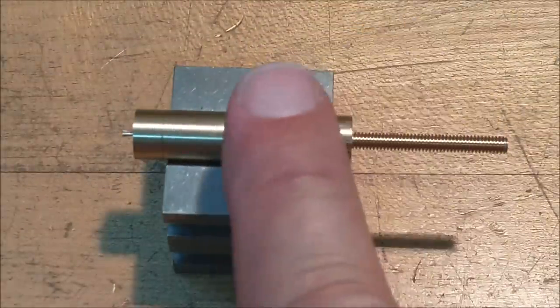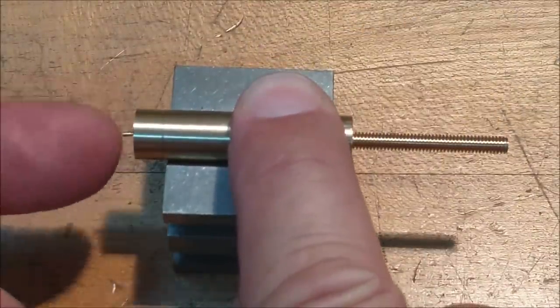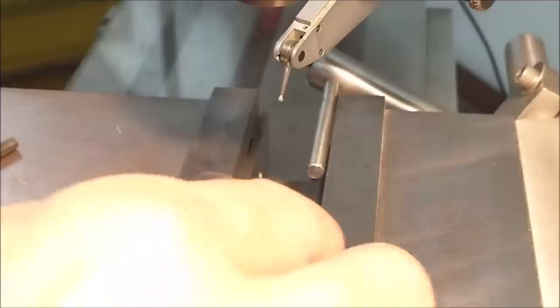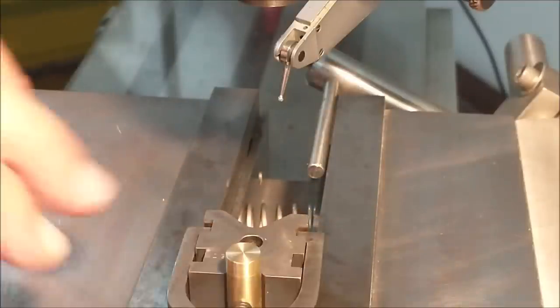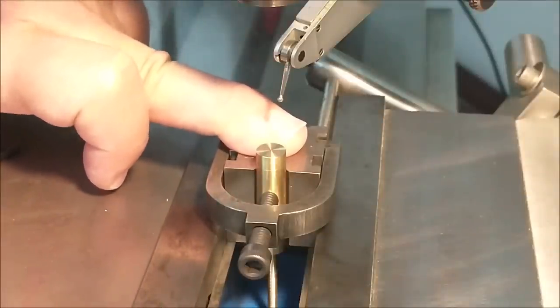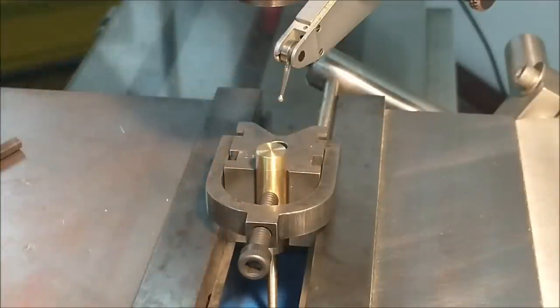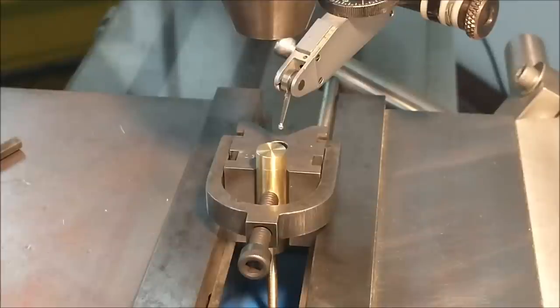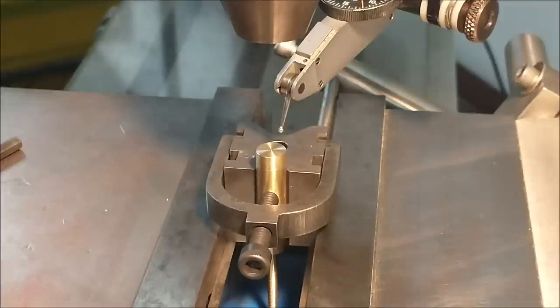Easily squeezed in a V-block, held vertically in the vise, I can now drill and tap the two holes required in the end of this component. I think the benefit of this particular approach is fairly apparent. Once it's in the V-block, secured, I can adjust the length. I've used the exact same setup to face off the end before this operation. Just going to drill and tap two of the mounting holes in there and call this piece complete.